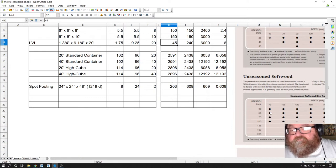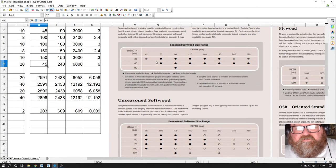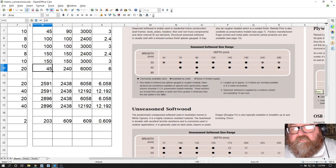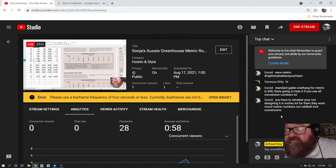Right here it says seasoned softwood: 35, 45, and 90. Down here it says unseasoned - we don't want to use that lumber. I was using 45 by 90 - see, this little black dot means commonly available sizes. So we'll have to use that. You have to remember you're not designing in inches for them. My little downloaded chart is telling me that 45 is more common. Let's go back - it's kind of blurry because I had to import it into Excel or OpenOffice as a JPEG. This says 45, which is as close as you can get to inch and a half in our numbers.